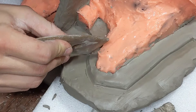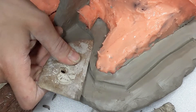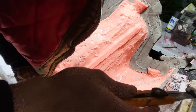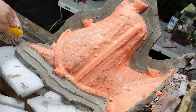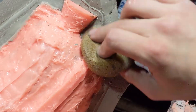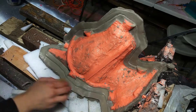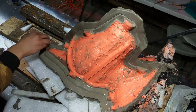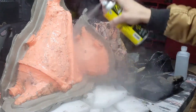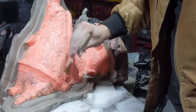Just make sure your key is beveled. The less of a bevel there is, the more friction there's going to be when you're demolding, and more of a chance of gradual deterioration over time. At this point, I'm going to trim my clay edges a tad bit with my knife, making sure to leave myself enough room for bolts when I apply the paste. Then I'm going to give my clay a final smoothing with a wet pottery sponge — it helps blend away the lines from that rough smoothing process. I'm dragging the sponge along in one direction, but most of the time it's better to go in small circles.